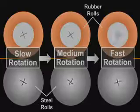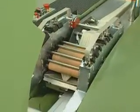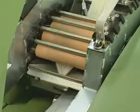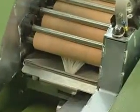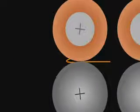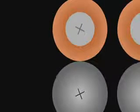The machine draws out the slivers being fed and reduces their total weight back down to the approximate weight of one sliver. In doing this, the trailing ends of the gripped fibers, which may not be completely straight, are straightened out by the slipping and pulling action imparted to them.